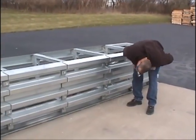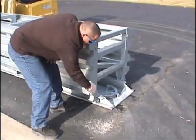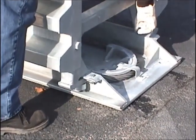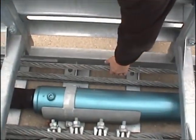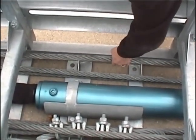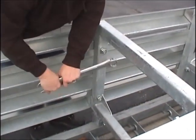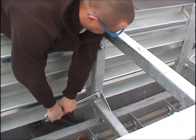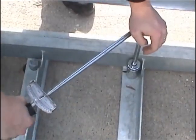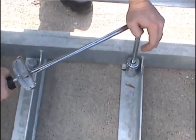A final inspection should be performed next. Make sure the sled is all the way forward up to the stop bolts. The cable should be taut but not over-tightened. A routine bolt inspection should be performed to make sure that none of the bolts loosened during transit. After the epoxy has cured, finish torque the anchor bolts to 125 foot-pounds. The SCI 100 GM is ready to be put into service.